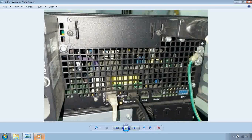Step number two: turn off all UPS outlet groups from the UPS control menu. The reason to turn off all UPS outlet groups is that this APC UPS model, the SRT 5K XLI, does not support firmware update with output on. So turn off all outlet groups.